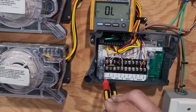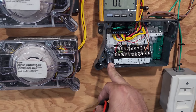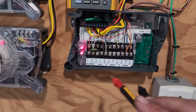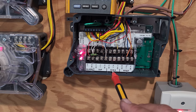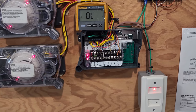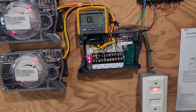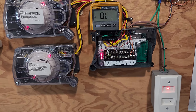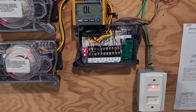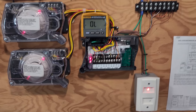We set off the alarm and sent the signal to the fire alarm panel. At the same time, we want this duct smoke detector to stop the air conditioner from running. We send a signal via the aux contacts to shut down the equipment. Depending on the manufacturer, it depends on how you have it set up — Trane and Carrier want you to break a circuit, Lennox you want to make a circuit. Regardless, you need to read the installation instructions so you know how it works.